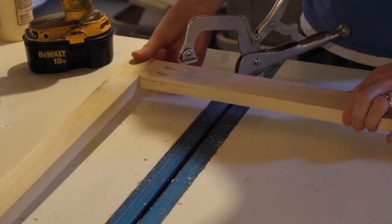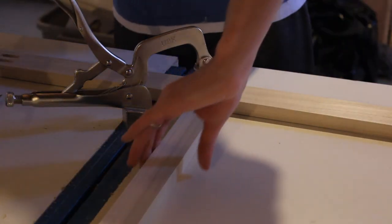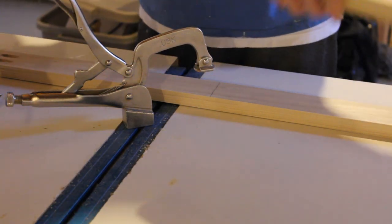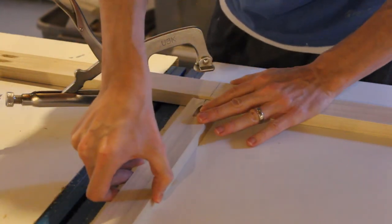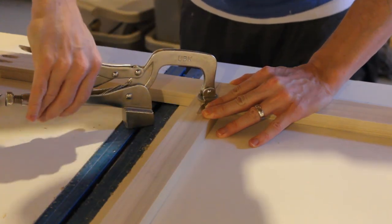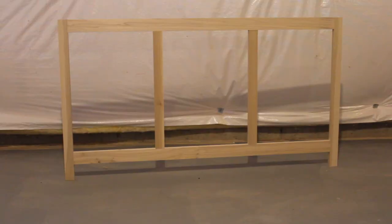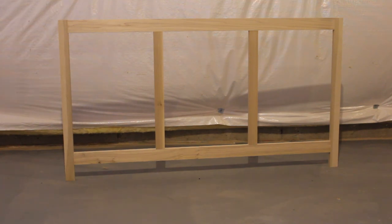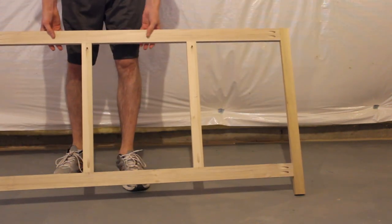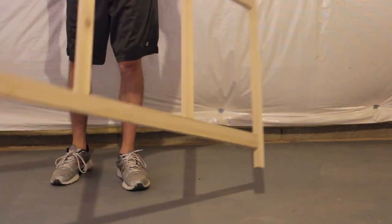For the center boards, I marked on the top board where they need to be positioned and put a line in the middle of where that center board sits so I know where the center is. I just line those two lines up, clamp them down, and screw them together. I did that for both C boards, and then I did the bottom board. That's really all there is to this face frame construction. Here's the front view — it went together really easy. Here's the backside where you can see the pocket screws: just the top, bottom, and middle pieces. That's how you build a face frame.